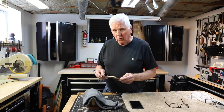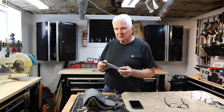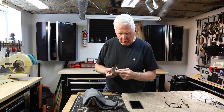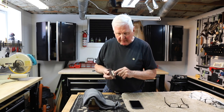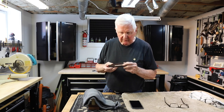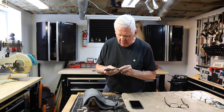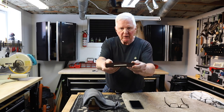There it is — it's perfect. We got the slot cut and just because we can, I took some bone, cut it off and rounded it by bumping it on the disc sander and then doing it by hand. And there it is — there's what the saddle is. It fits perfectly. There's no movement whatsoever. And that's what it's going to look like.